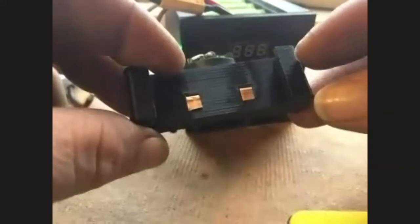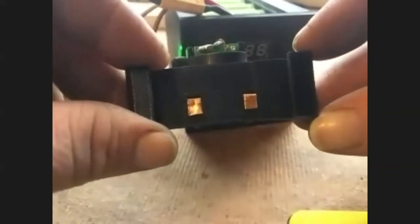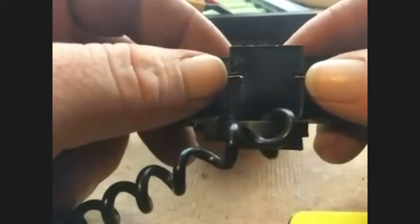I added some slots for copper tabs, and this is another boost-buck converter. What this does is allow me to charge my Baofeng radio while I'm using it. It just goes into a 12-volt cigarette lighter and slips on the back end of the radio. I have the charge controller set to 8.2 volts — that's what the Baofeng radio wants to charge at.